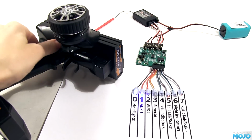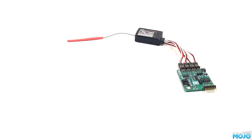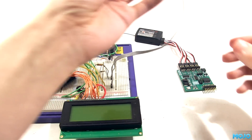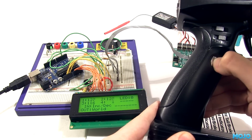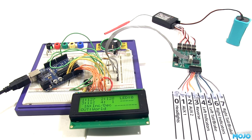So there we go. That's what's available on the board, except it isn't. There's that 6-pin header called Expand just sitting there. I've not got anything ready to sell that uses it yet, but I have my debug rig. The connector streams serial data out, which we can use with the slave device. If I connect it all up and turn it all on, we can see on the screen all the function states on the controller. If I change the preset, you can see the display change with the LEDs. The button on the controller also sends its state, and here's the fun one. If I toggle channel 4, yeah, there's all sorts of things that we could add and be controlled with this system. I'm just not entirely sure what as of yet.